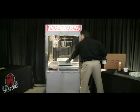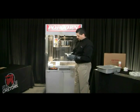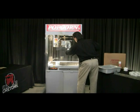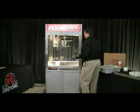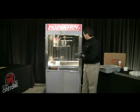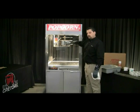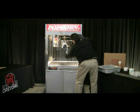The outside kettle cleaner is more like a paste. Take a damp rag, put a little bit of the outside kettle cleaner on your rag, and work it onto the pan. It's kind of like a wax or a polish — it does have a little pumice, a little bit of abrasive, but it's not going to damage the finish. Once you get it all on that surface, leave it there and let it dry up — it'll haze over a little bit. At that point take a dry rag and buff that out. You can see how it's cleaned up and polished the outside of the pan.